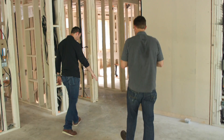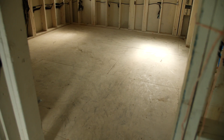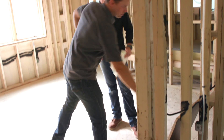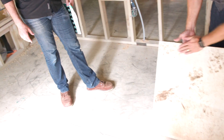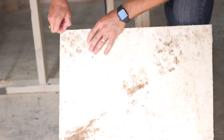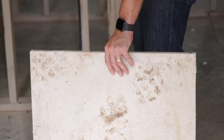This decking on the floor doesn't look like anything I've ever seen before. This is magnesium oxide board, or MGO for short — first time using it, along the same thread of indoor air quality. It's three-quarter inch material. It looks like glorified drywall, but if you look closely you can see a grid pattern — a webbing of fiberglass mesh on both sides and one layer in the middle, and that's how they get their structural rating. We attached it with nails and a zero VOC glue.